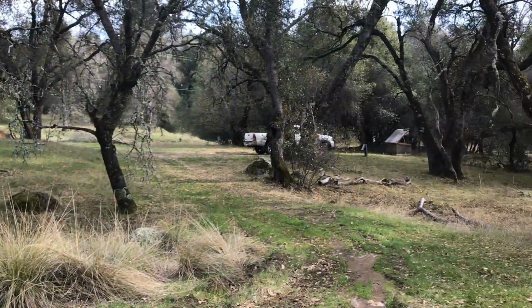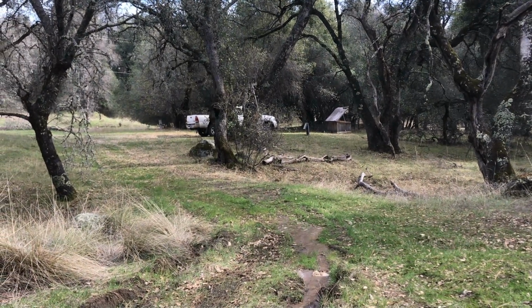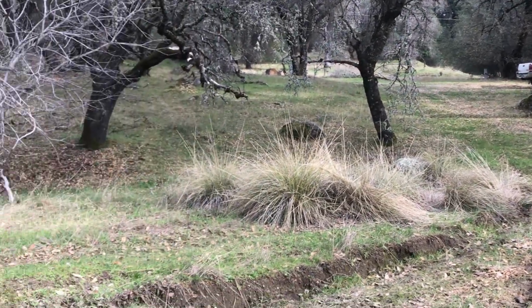We have finally got the south well over there running out clean water, and that took about an hour. The north well is still working on getting clean water, and it's probably been 3 hours, and it's definitely decreased in the amount of chlorine. The decrease in bleach is a lot, but it's still there. It's a deep well, so I'm figuring it's going to take a little while. But now that the south is all clean, because it's such a strong well and it pumps a lot of water, it's cleaned itself out.